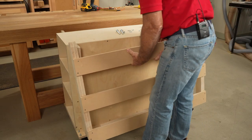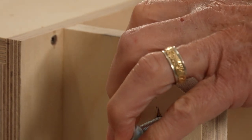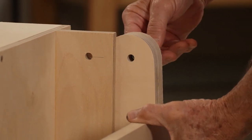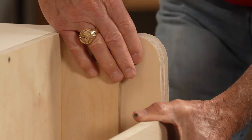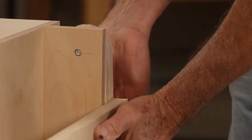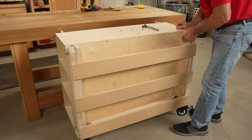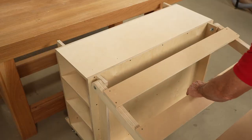Now it's time to place the drop wing assembly on the table. I place a washer on the outside edge of each swing arm and insert a 3/8-inch bolt, then connect the whole assembly with another washer on the inside, a lock washer, and finally the nut. I tighten the nuts on both sides for a smooth pivot of the drop wing. Now I can raise the drop wing and extend the feet to check the fit.